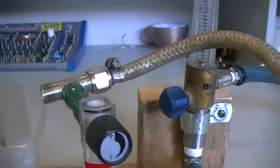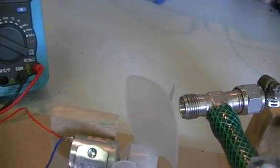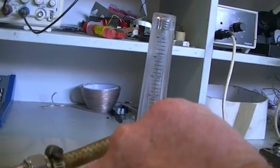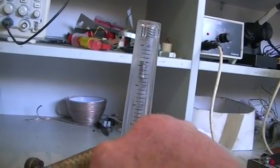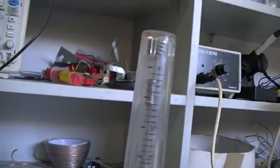What we are going to do is lift our flow rate up to 3.8 litres per minute. It may sound like more than that but it is not — we are squeezing it through a very small hole, which is up at the end of the nozzle there at 1.6 mil. It kind of echoes inside this tube a little as well as hitting the fan. We'll lift the flow rate up to 3.8 litres per minute.